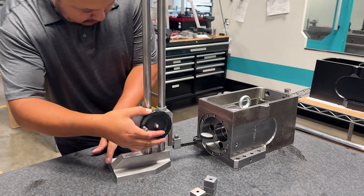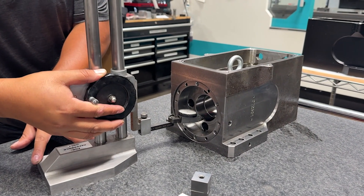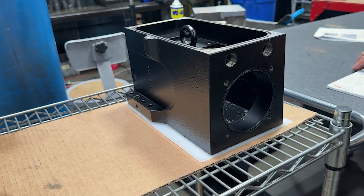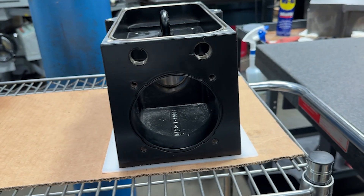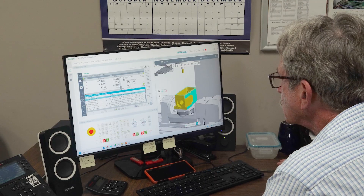The parts are coming out excellent. Everything's being controlled in there by itself. What the probe is reporting to me and what the bore gauge is reporting to me correlate. The operator has not had to adjust anything — it's just load it and run it. Being required to be present at the machine is basically eliminated. There is a point where he double checks the part before he removes it, but other than that, the cycle just runs by itself. The operator is busy doing other tasks.